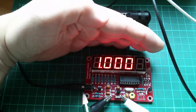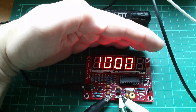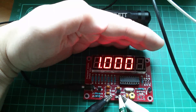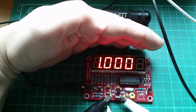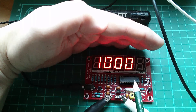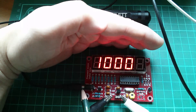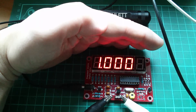I should say that I'm powering this from 5 volts from a power bank. I've looked up this 7550 voltage regulator and it's a low dropout - the dropout is in the datasheet as 100 millivolts. So even if the input is exactly 5 volts we've got 4.9 volts going to the PIC. Often these USB power banks put out slightly higher than 5 volts, so if it's 5.1 or 5.2 then we've got the full 5 volts going to that PIC microcontroller.